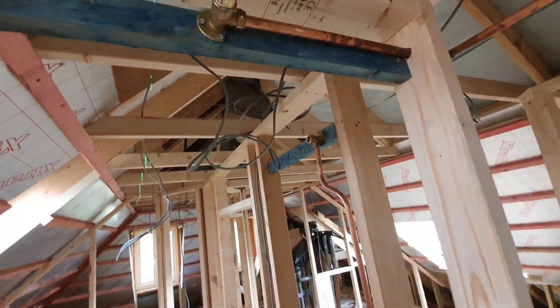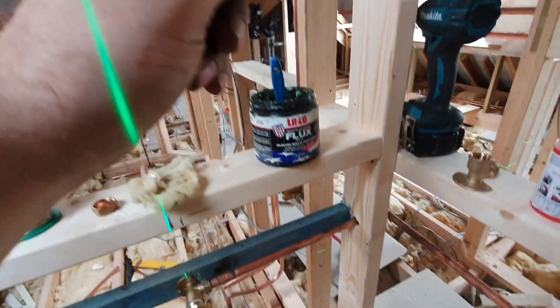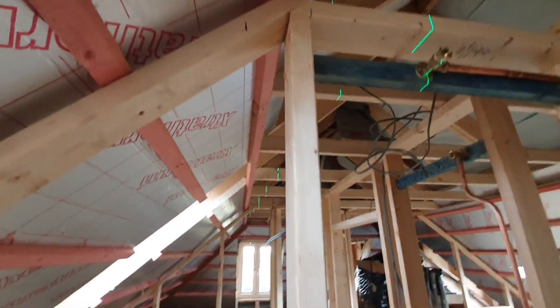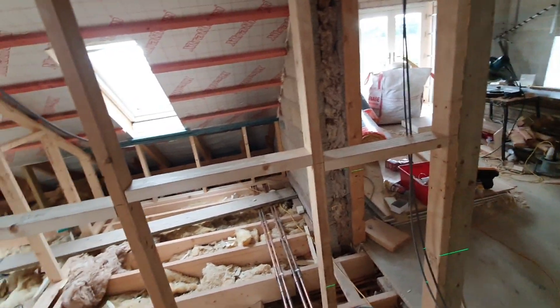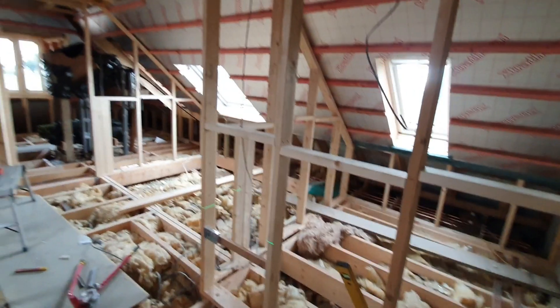Got these back plates all set up for the shower. That's the main head one at the top, and the rinse one - that'll have a riser coming up one side. Just got to move them basin pipes across a bit. This is a 700 shower tray going in so you can still get the screen in for the window. My controls are there, that side's all done now - ready for the shower over the bath. Over the weekend I'll get the cylinder and boiler and everything put in. I've already moved the kitchen sink temporarily on speedfit so I can disconnect it easy.